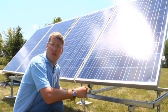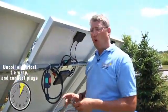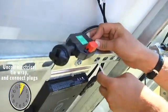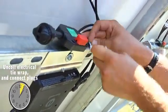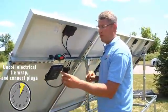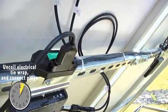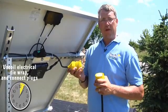What we have left to do is some electrical hookup. Next, we're going to release the coil from A1 — make sure that you only cut this one tie wrap. String it onto A2 and connect it with tie wraps. Now we're going to connect the inverter plugs to the AC cable. First, we have to take off the red cap and make the connection. The final connection we make at the solar pod is with a weatherproof twist lock plug.